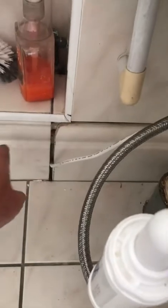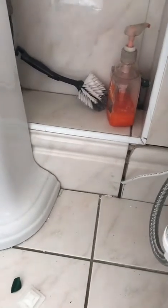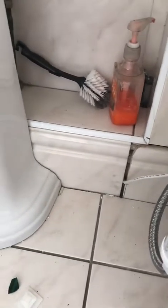You've got to wire it into the mains somehow. It comes with a two-pin plug. I wired it through this trunking, took it along under the bath, and found a fused socket in the airing cupboard just here — it hadn't been used. So I've wired everything through to that, giving you a 13-amp fuse away from the bathroom. If you can find a way of drilling through your wall to link to a socket in another room, it can be done. I cut the two-pin plug off and used a junction box to link the wires.